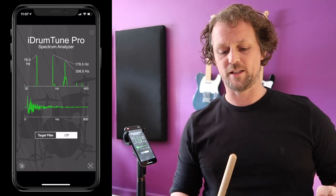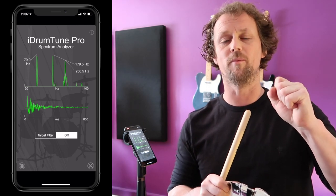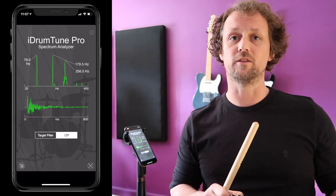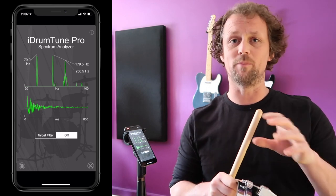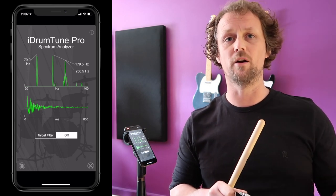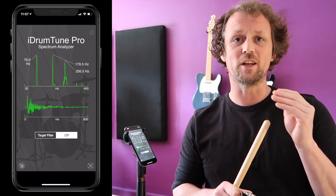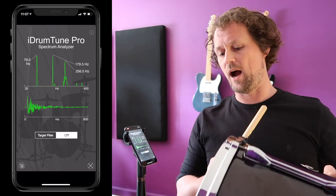And it's no surprise, actually, that with a constraint, so when we hold something firm, it tries to stop it vibrating. Well, that also encourages it to vibrate at a higher frequency. And that's generally because we're stopping some of the modes. We're allowing others to vibrate, but essentially we're changing its capabilities to vibrate.